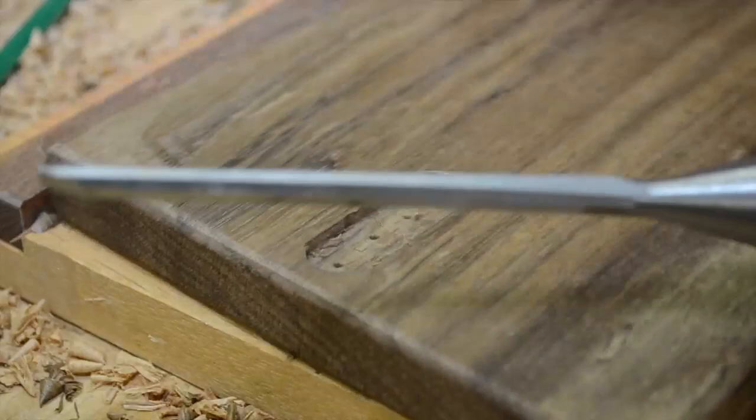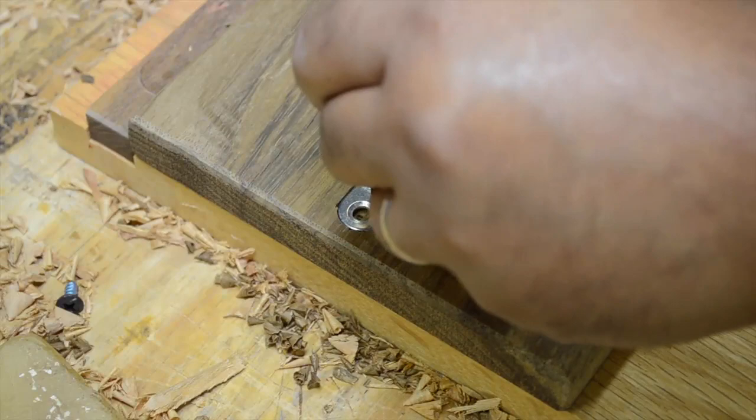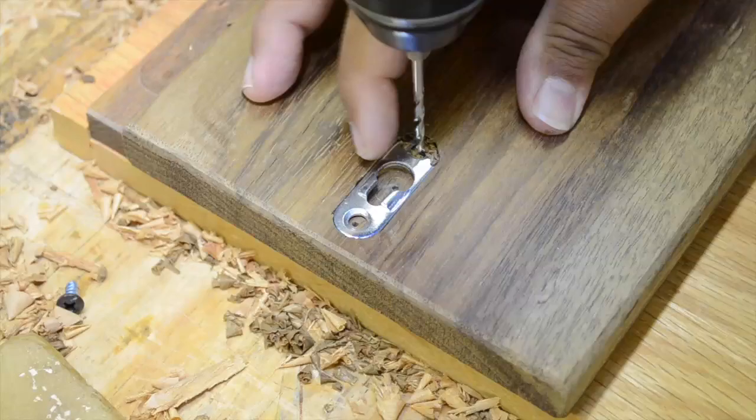Now, once the keyhole clip fits in place just right, it's time to mark where the screw head is potentially going to be touching the surface of the wood. I want plenty of clearance for whatever size screw head they end up using. So we'll drill a little bit deeper with the same Forstner bit in this location, and then we'll test for clearance. This is fitting. Now it's time to pre-drill for the screws to attach it in place, drive them into position, and we're all done on the back.